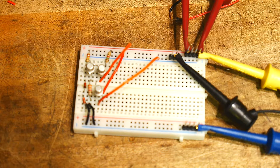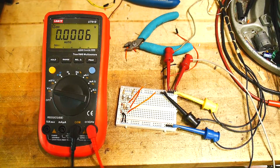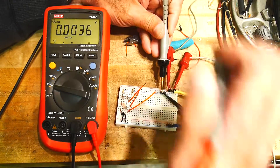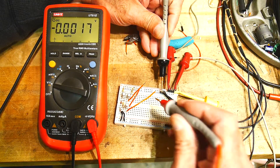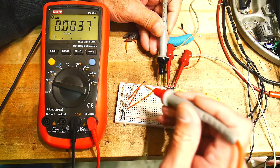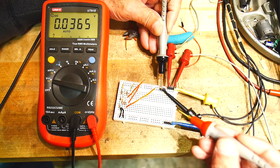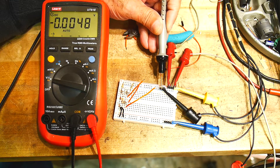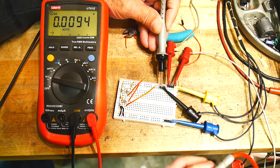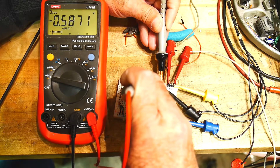Let's take a look at what's going on voltage-wise in the circuit. We have plus 12, minus 12, and the input grounded to zero. Let's look at what voltage those two emitters are at — they're right here — and they're at minus 0.58 volts. Does that make sense? We have the minus input tied to ground, a constant current source, and a base-to-emitter voltage drop. So the emitter will be a diode drop below the base. If the base is at zero, the emitter is at about minus 0.6V — and we're reading minus 0.587V, so that makes sense.